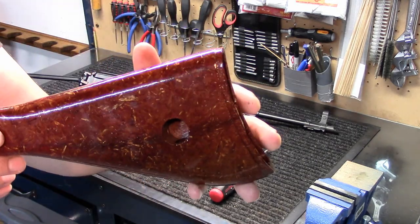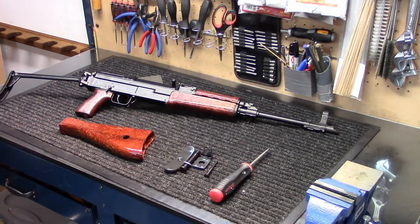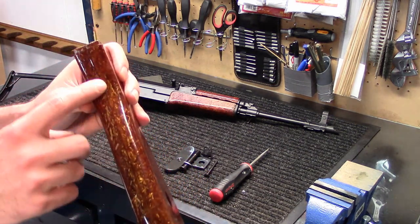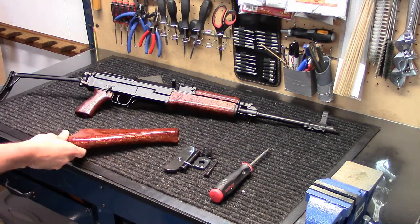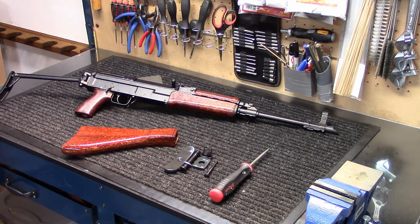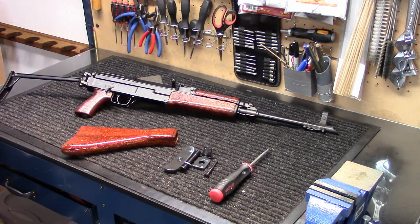As you can see, it's much better off now. What I did was — starting with sanding — the seams along the top and bottom were in pretty rough condition. I sanded those with 320 grit sandpaper just to get it down to a more consistent level. From that point, I put on three coats of the Birchwood Casey True Oil, letting it dry a couple hours between each coat, then sanding and applying another coat.